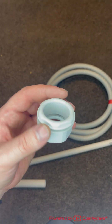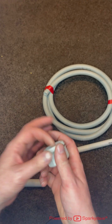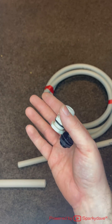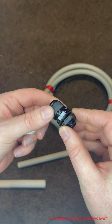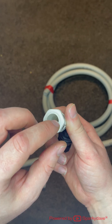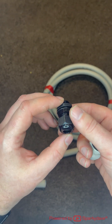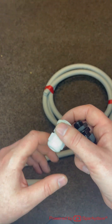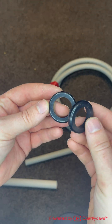Bushes aren't generally used with conduit because conduit fittings act as a bush anyway when you've got the plain screw adapter through the board. The last fittings are glands — these are nylon glands. This one is an NG16, a nylon gland 16mm, and this one is an NG20, a nylon gland 20mm. These glands are used for flexible cable penetrations into conduit or other fittings, so the cable can go straight through and out the other end into a motor, hot water cylinder, or other appliance.